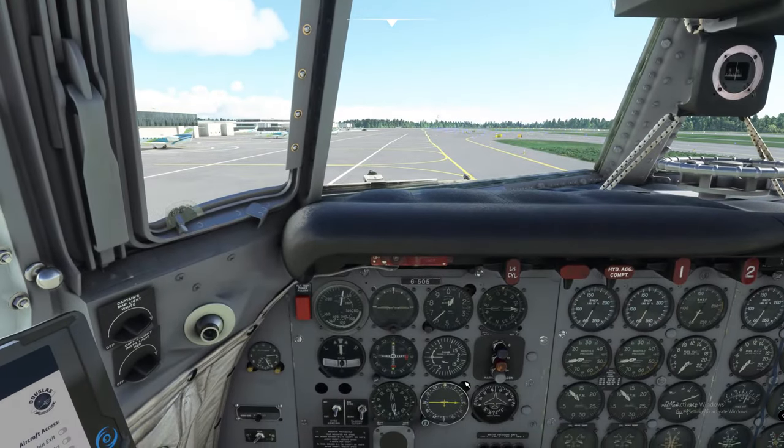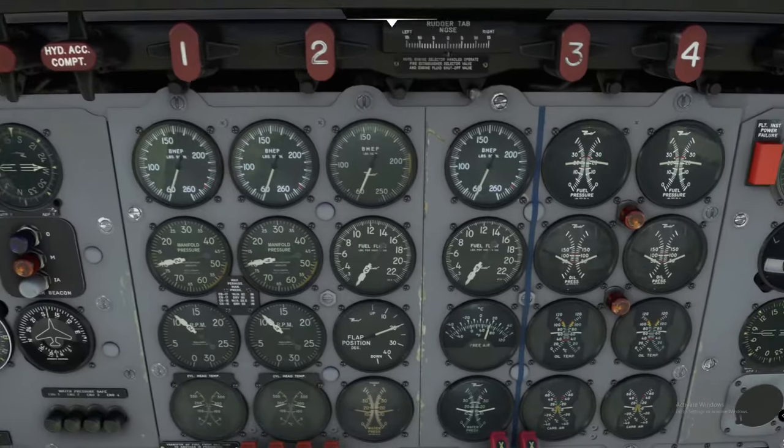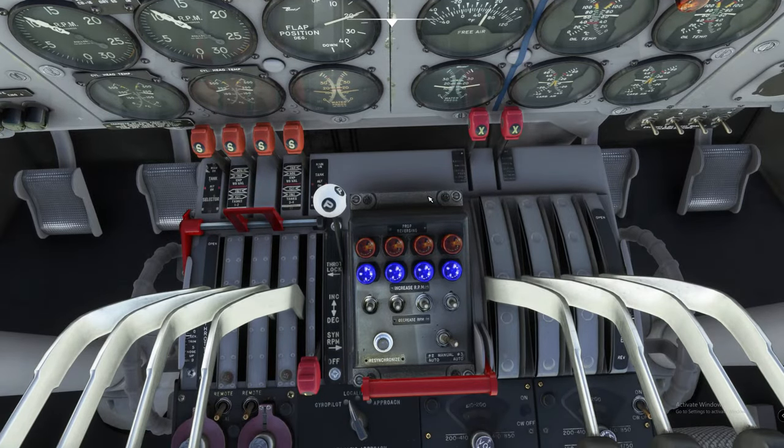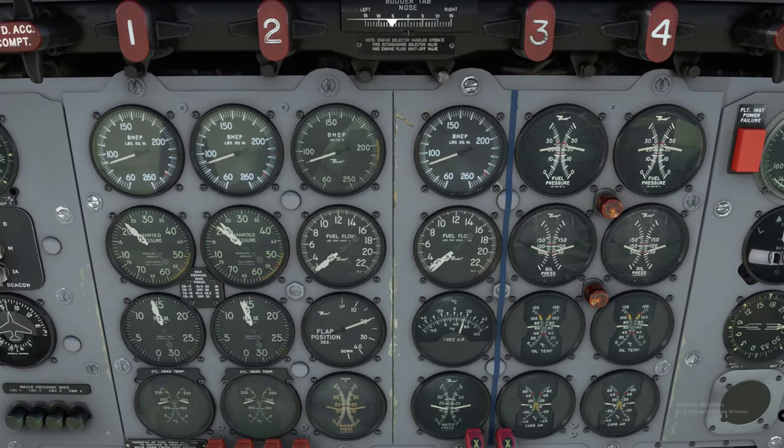The next part in the sequence is the run-up procedure. The brakes are set and engine instrument temps and pressures have been checked — we can monitor all of our temperatures and pressures down here. The first thing we need to do with the prop check is the prop governor check. The prop master lever should be in full forward, which it is. Note the RPM limit lights that are on are blue. Select the engine master switch to 3 and auto. Set all throttles to obtain 1,600 RPM — I would say we've got them at 1,600 RPM right now.